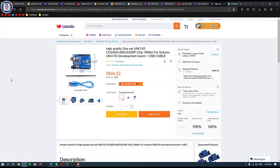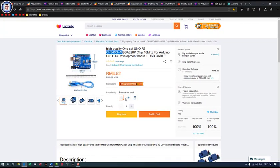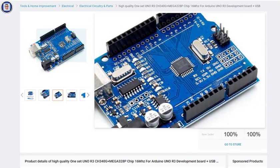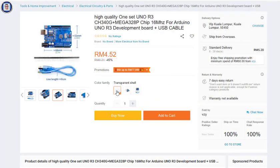I will start with the one to avoid. Like this one, for example — they say it's a high quality Arduino R3 set, but the price should already give you a hint about why not to acquire this one. You need to be careful. If you take this one, which means the Arduino will come with this chip here, then you will have trouble plugging into your computer and loading Arduino sketches. Basically, this is only the transparent shell.